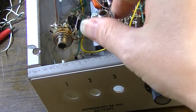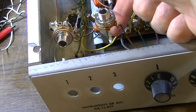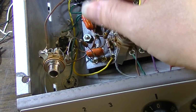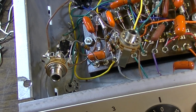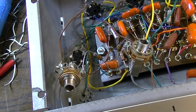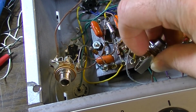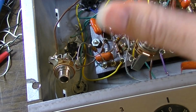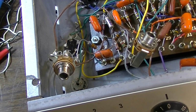Because the other thing that this is doing is adding noise. Because you've got basically another antenna coming off of the same point, and that's all it is. It's just an antenna hanging up in the air. And if this was dirty and this contact was dirty right here, this whole thing would just be a big antenna making noise, which is what we had a little bit ago.